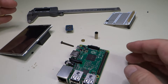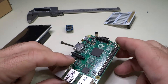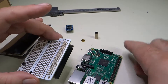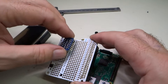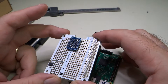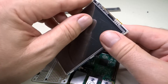Now we're going to show you how stacking works with the Pi. You have this row of GPIO pins here on the Raspberry Pi, and we want to be able to bring those GPIO pins out to a breakout board, where you can use them for servos, sensors, and other things, and mount level converters like this, so that you can utilize those GPIO pins. But you also want to be able to use displays, such as this display.